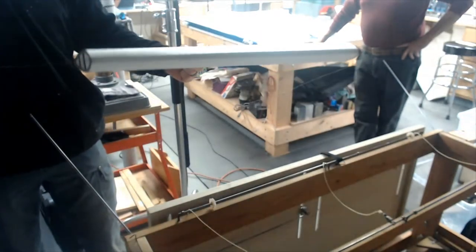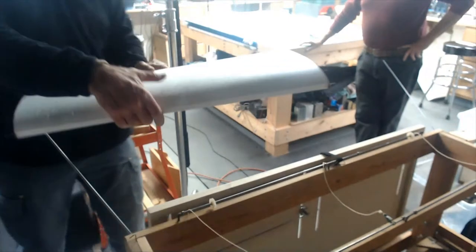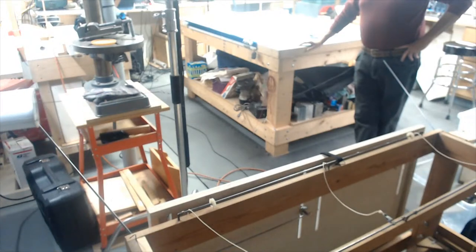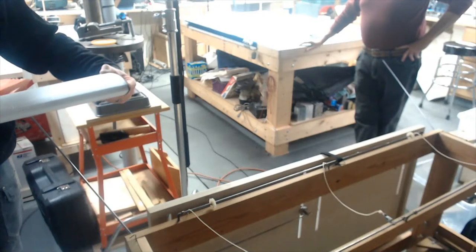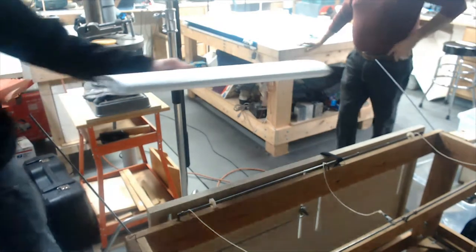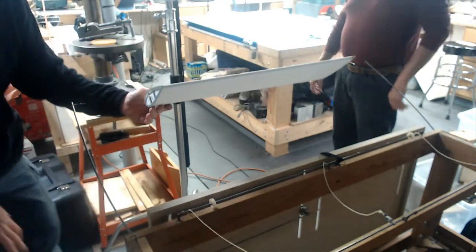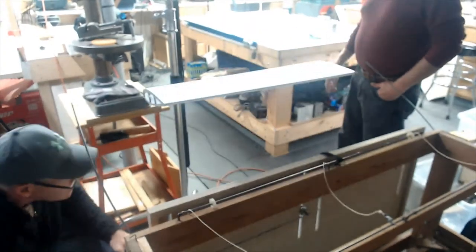But you start to lose accuracy on the core. And also, what I like to do is sheet the wing before I ever core it. Normally, when I do these wings, I vacuum bag sheeting on while it's in one piece. That way it won't crush on you. Right. And even vacuum bagging 1 pound foam, it's only like 7 inches of mercury. Now, I assume it's going to take half the voltage. Now, this is three times for each panel that you have to do this. Correct.